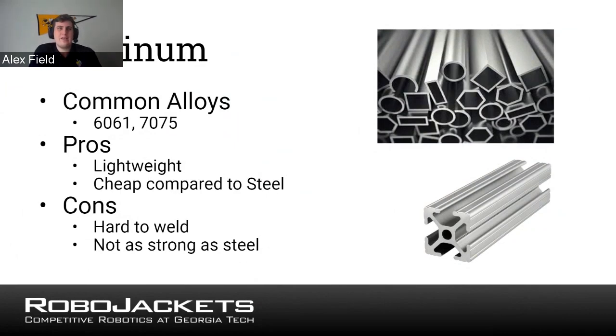But the main thing is when you are looking at what materials you're going to use, you can look it up if you're ordering a material to get cut for you. You will see these as choices, so it's important not to get lost in the codes, and to focus on these right here. Again, 7075 will be more expensive, it's a little harder. 6061 is the most common and the cheapest, so you'll probably be using that.